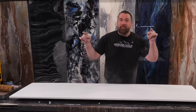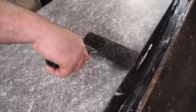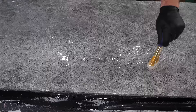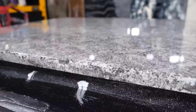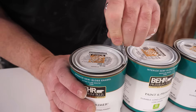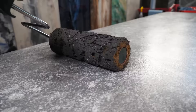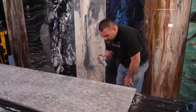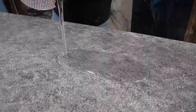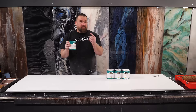We're back for another roll-on granite epoxy technique. This epoxy technique is perfect for first-time epoxy users or epoxy pros — this project is mega quick and easy. I'm going to start with my lightest gray color and work to the darker colors, then come back to my lighter layer. The cool thing about this style of project is you're going to know what your countertop looks like before you even mix up any epoxy. This is latex paint, semi-gloss, and I want to make sure it's completely dry a good few hours before applying epoxy.